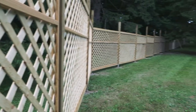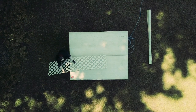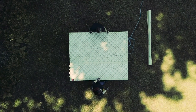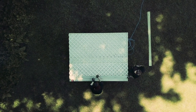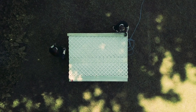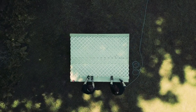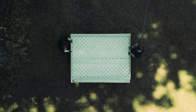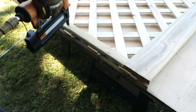We are going to build the lattice frames — approximately 6 feet tall by 8 feet wide. Grab a 2x8 and a 4x8 sheet of lattice. We're essentially going to make a lattice sandwich: using two 8-foot 1x4s, sandwich the lattice between the boards and nail together with a pneumatic finish nailer. Repeat on the other side. Then add the vertical sides using 1x2s — cut them to fit and nail together.